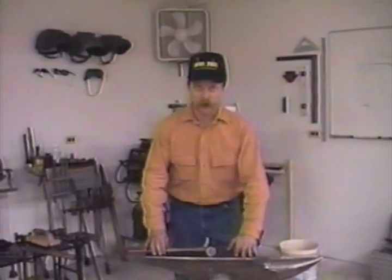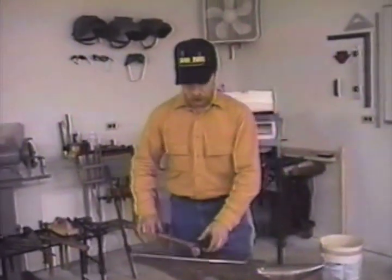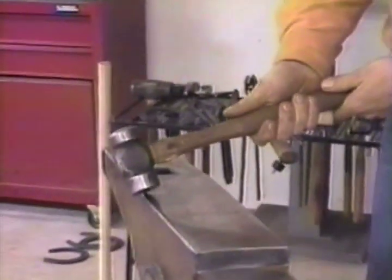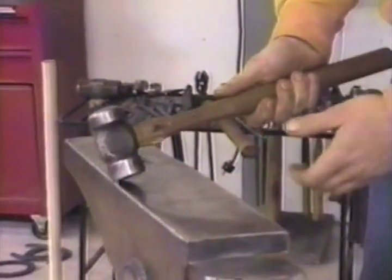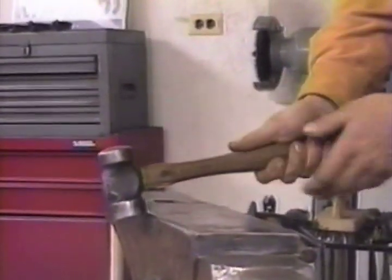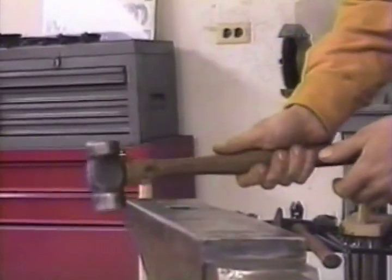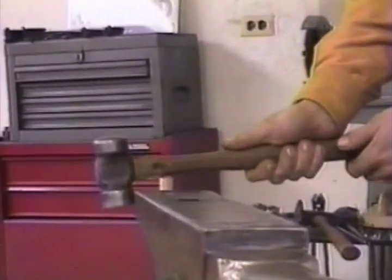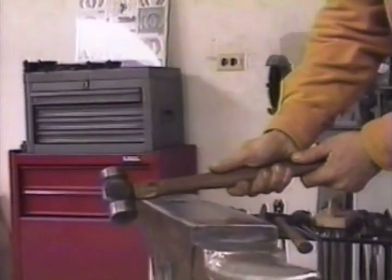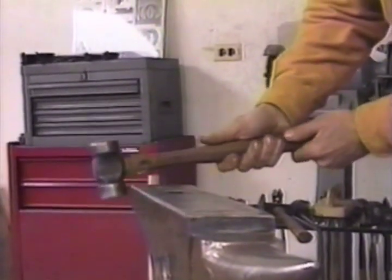Now we've chosen the height of our anvil. Let's go on to the next tool, and that is the hammer. The handle must fit comfortably in your hand. When I put my thumb on top of the handle where it rests, this is the direction — the thumb guides the hammer through the movement, regardless of whether the hammer is working straight or slightly turned. It always sits on top.